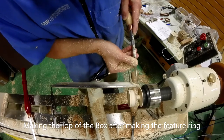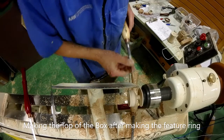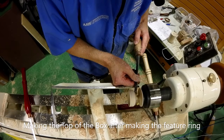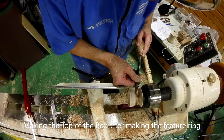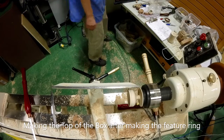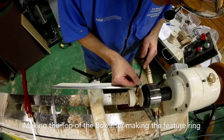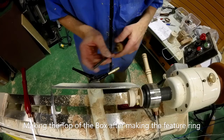Not a good angle to cut, right? The way I'm sitting here. Right. Just bring that tool rest lower. Before I go thinner, I do more final cuts with this. And every tool has its final thickness. So that's a detail gouge, similar like a spindle gouge, just has a more acute angle.